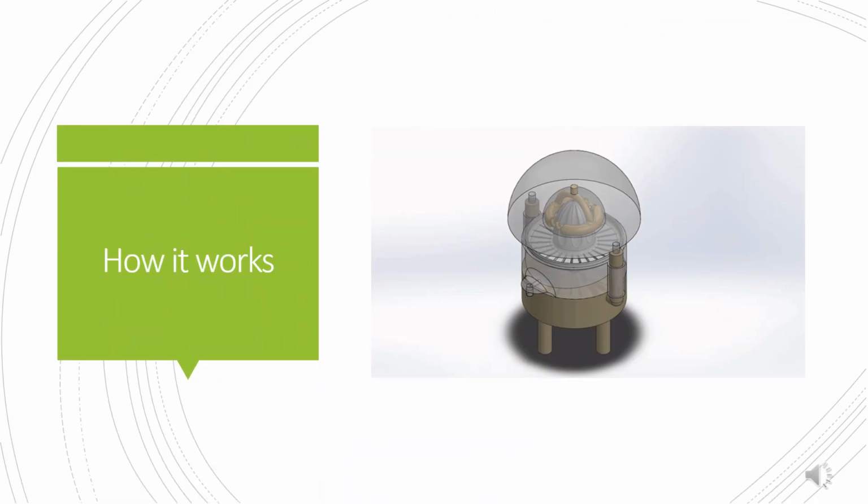This electric household juicer is operated by attaching a half-cut orange onto the clamp. The spring-loaded clamp is attached to the cover, which is pressed downwards. As it is pressed downwards, it compresses springs which are in contact with the pressure plates that turn on the motor. The motor drives a coaxial gear train which turns the reamer.